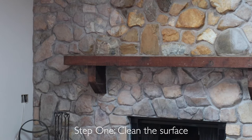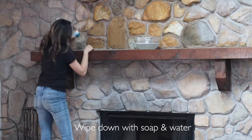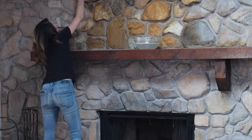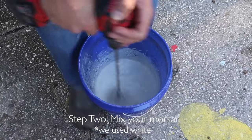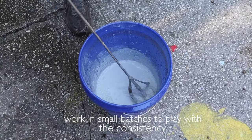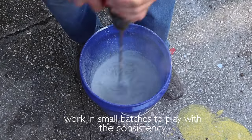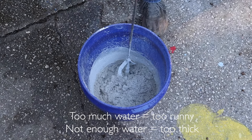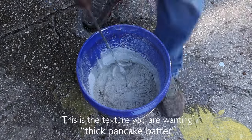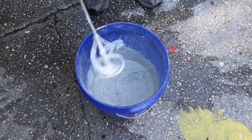What you're going to do is clean your fireplace really well using soap and water — I just use Dawn dish soap and scrub it. Now here's the mortar mix. We used white mortar mix, and if you add too much water it'll be very runny. We added a little bit too much and it got too thick, but the great thing is you can just water it down lightly. We used our hose and got that pancake texture — that's what you want.